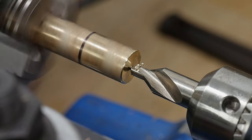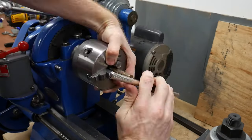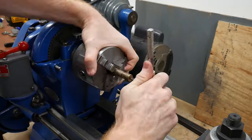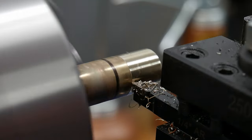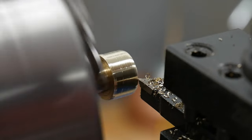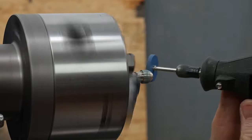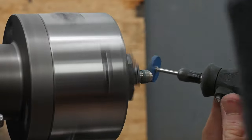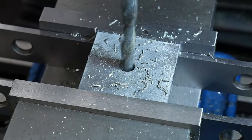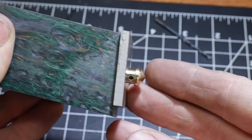This was definitely a setback, however there were silver linings. The handle did get bedded to the tang nicely, and being forced to go a different direction was a net positive for the project. The larger piece of bronze made constructing the pommel nut easier and the final product was surely more robust than the small copper counterpart. I also decided to go with a more rounded pommel nut design since I didn't care for the pointy geometry of the copper nut. To accept the larger pommel nut I increased the diameter of the hole in the pommel to 5/16 of an inch with an end mill.